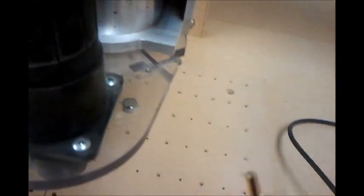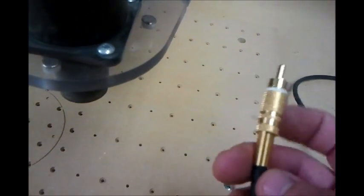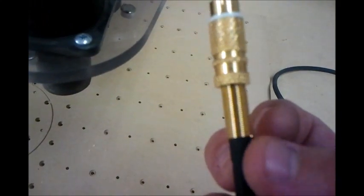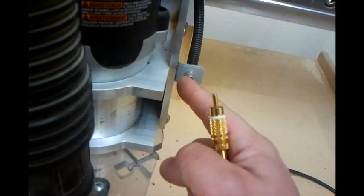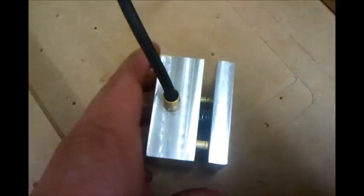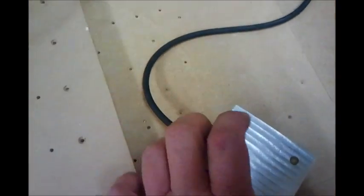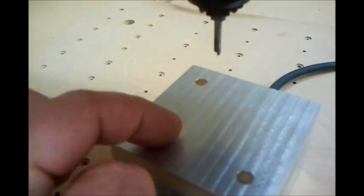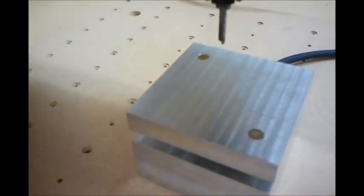In the RCA plug, the center pin is what I'm using. The outside would normally be ground and you don't want those to touch inside the wire — that's why there's a piece of heat shrink on the outside connectors. Because if you connect the outside and the center, you've closed your circuit and it won't function. So the center pin is basically now the positive side of my switch connected through the RCA, while the machine itself — including the router bit — is ground. When you bring them together you complete the circuit and the machine gets the input and knows what to do.